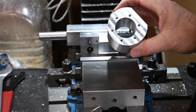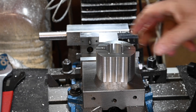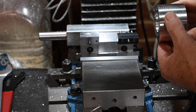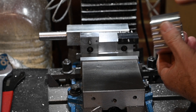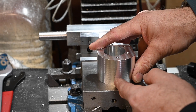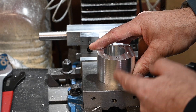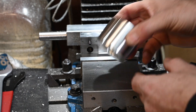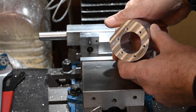This is where we left the last video — putting the holes in. We've now got the holes top and bottom. What I've got to do is put the dividing head on here so I can rotate it to turn the outside features and get these angles on here. I was going to do it on the rotary table, which would be nice, but I haven't got a bit long enough to do the whole side, and I think if I do get a bigger bit it's just going to chatter. So I'm going to try this on the dividing head.